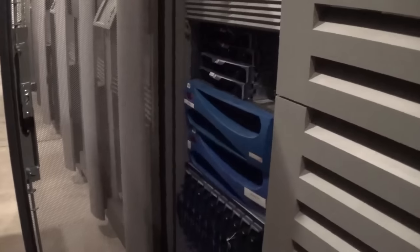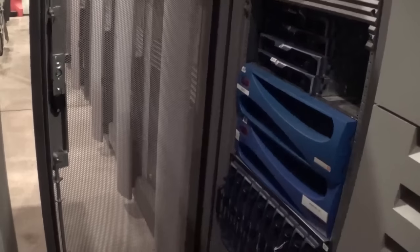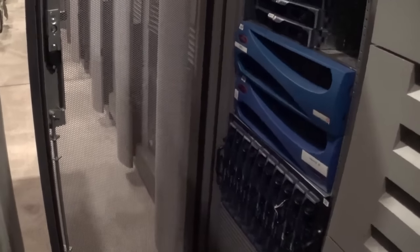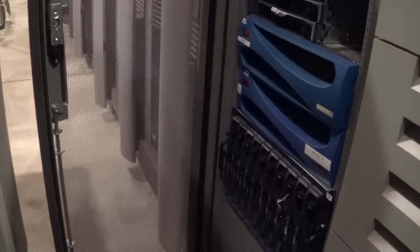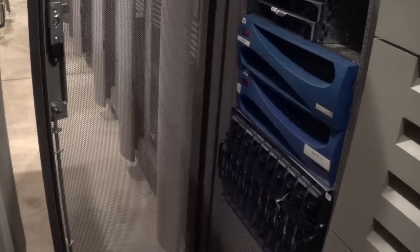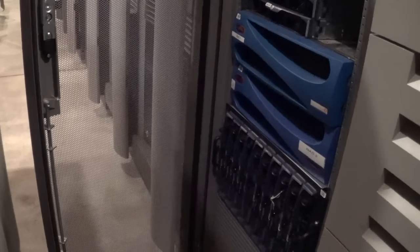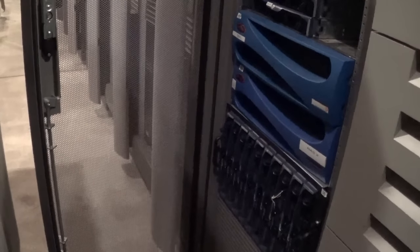Below that, we have some spare Dell 1855 and 1955 blades. Below those with the blue cases are Lucent APX 1000s. They are TDM gateways. On the back you plug a DS3 in and it can split it out either to VoIP or to modem, so they can be used as remote access servers. And I worked for an ISP in New Zealand that used a bunch of Max TNTs as well as APXs for remote dial-in pools. Anybody want a 1000 port BBS?